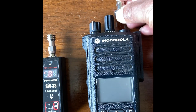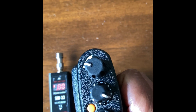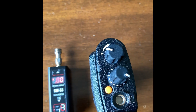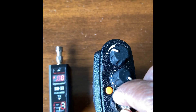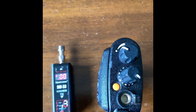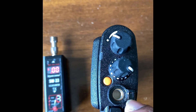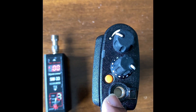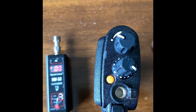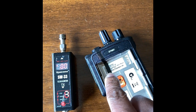We shaved it off so that it sits properly. You can see this is the BNC — you don't see the pin inside like the 3600s — so it fits in there. But using that alone isn't going to work. I've got a copper foil here, painted black, so it shouldn't touch the metal part inside. The way the antenna meets the radio, the copper foil should go from the outside all the way up to ground it.